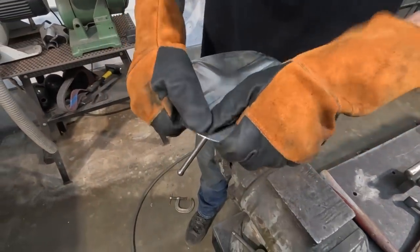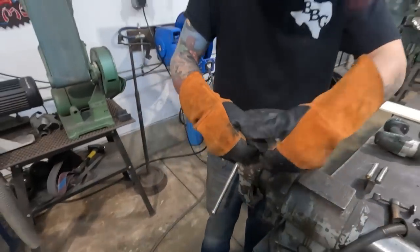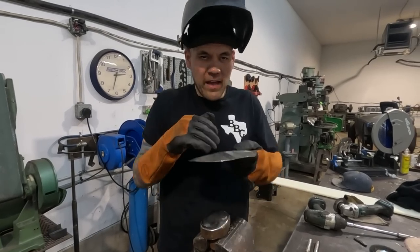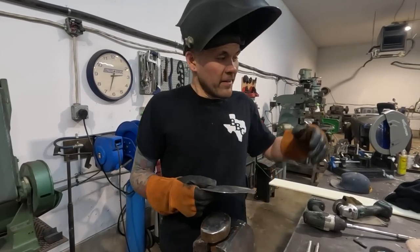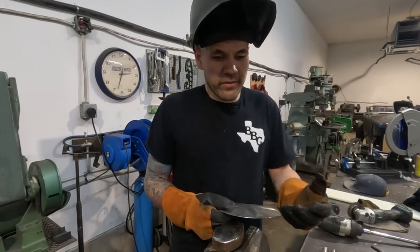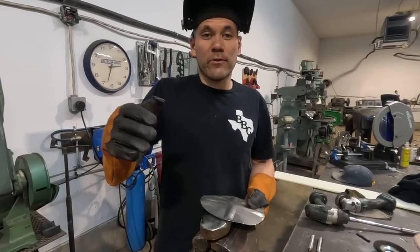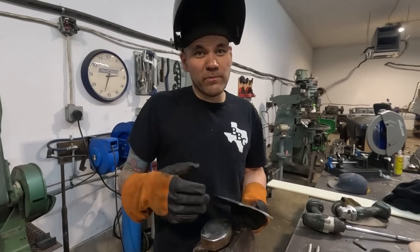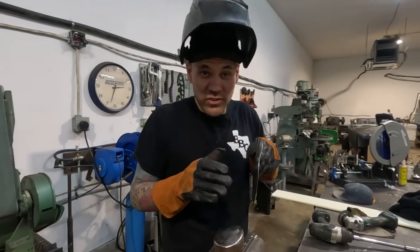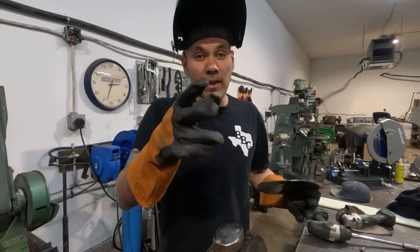That information is now in the panel. This material has been put into the panel. We already have our shape starting. This is not a huge amount of shrinking that's happening. In fact, I believe that the shrinking stump gets you the most shrink out of these techniques. There's a crazy amount of shrink in that stump, and most shapes don't require that much shrink, depending on what it is. It'd be more like a panel like this that just needs a little bit. So you can use certain techniques in different places depending on what you're doing.